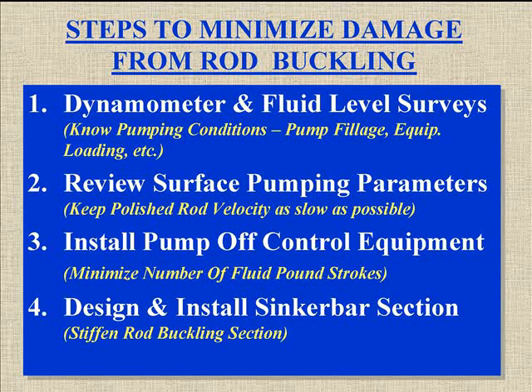Lufkin has recommended 1,500 as the maximum — that's just stroke length times strokes per minute, which would be twice as fast. So that would be slow, and that's the maximum. It'd be 3,000 the way you calculate it the other way. That makes sense, because that is moving pretty fast then.